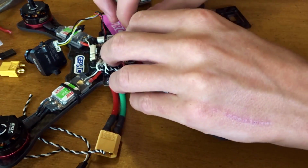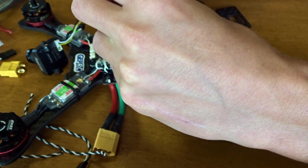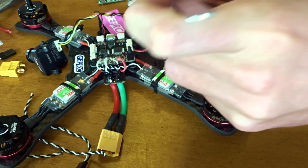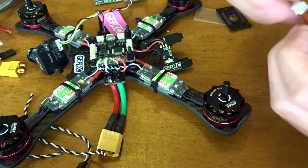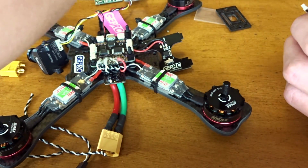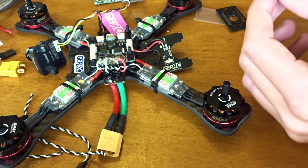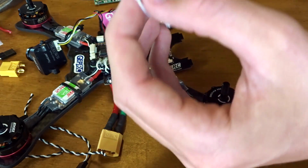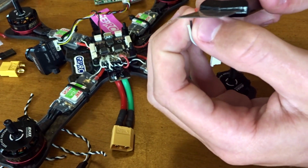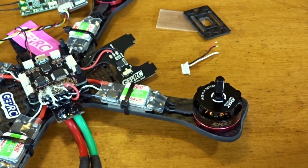Now I'm going to take the port back out. I should have thought of this. Let's get this back out. Be careful, especially now with only 3 wires, not to pull on it. You don't want to rip these wires out. Although if you do, there is a second cable exactly like this for the other side if you're doing PWM or something that you could do. So if you do mess up, you could get like a second chance. So now let's strip these wires. Now I'm going to tin these up over here.